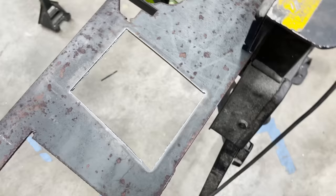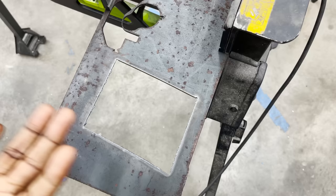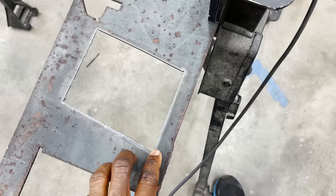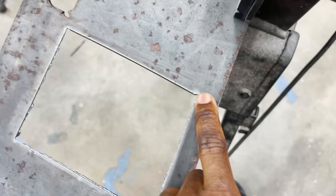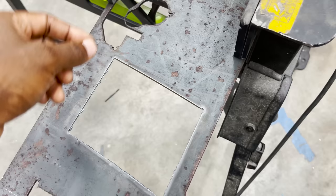It's a brand new day and I'm ready to take a look at the results. The cut came out pretty good — I wasn't trying to make a perfect square, I just sort of blindly navigated, and this is about the shape I expected. You can see there's a little circle in the corners because the robot was pausing there — that's a programming issue that's going to take a while to resolve. After each linear move there's a small pause where it's calculating the next move. You can also see that there's some dross hanging on the part, which is a combination of torch height, angle, and speed.